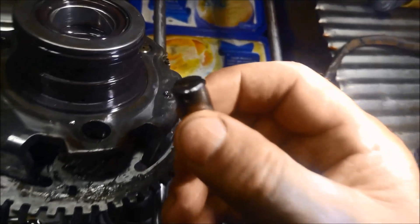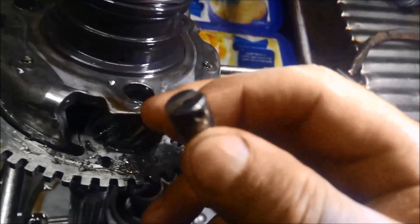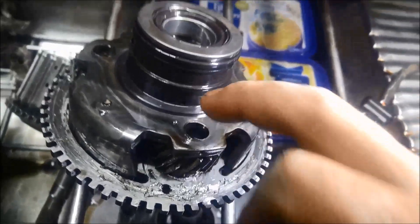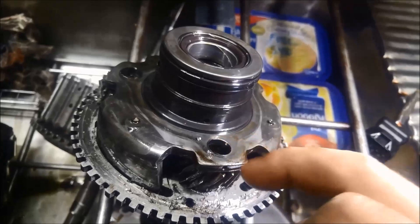So that's how you do the upgrade on it. You actually drill that hole all the way through, and then that'll go into the other side of the housing over here, and that pin will be a lot stronger.